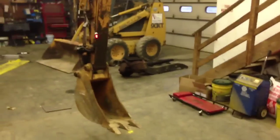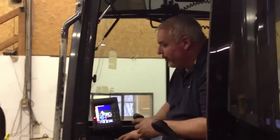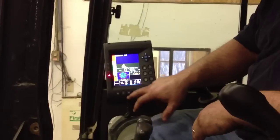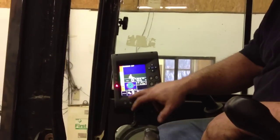You can see the flashing lights — a little gray right now — so your LEDs are strobing to tell you to go up. If they're off, you're above grade. If they're on solid, you are on grade. And if they're strobing, you are below grade. Right now we're one inch below grade, you can see. We can turn the speaker on — you can hear it beeping because it's low — and we can turn that off.